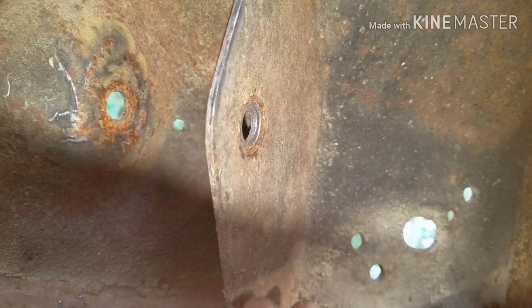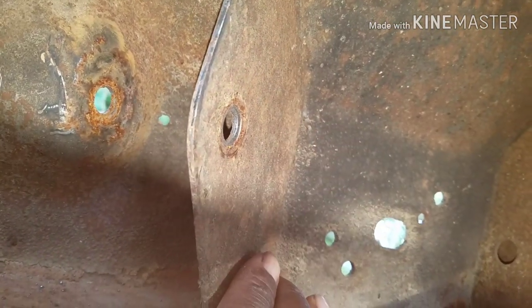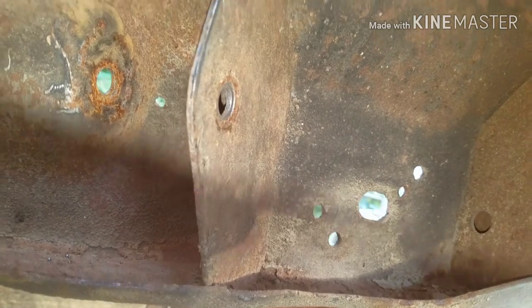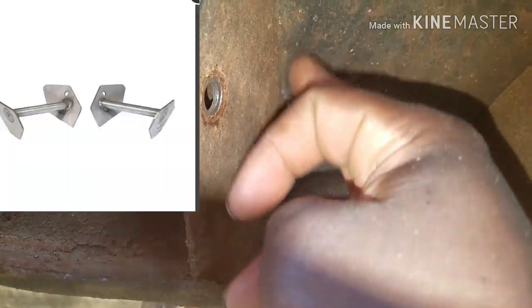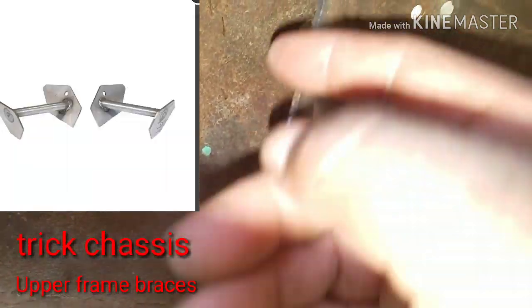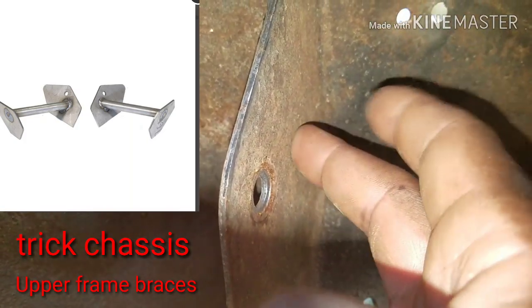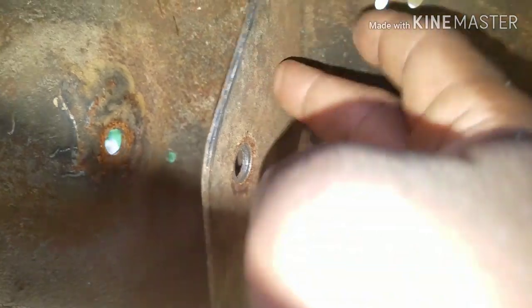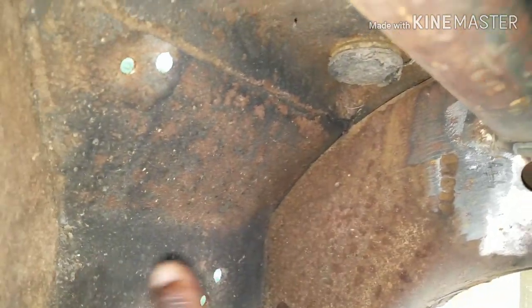the size of this plate right here. I cut me a template out, drilled 2 holes, plug holes so I can weld to this. I welded on the side, then I welded up on the front of here. Then I did 2 or 3 holes where I can plug weld onto this bracket. Then I did a brace from here to over there. I might go show you on the cutting frame right quick.